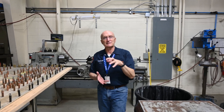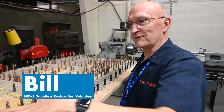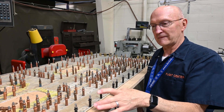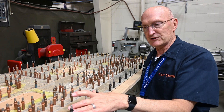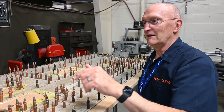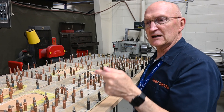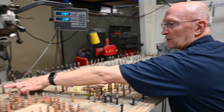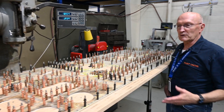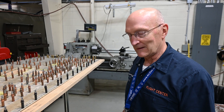This is the bottom skin for the SBD. The bottom skin has got so many inspection holes and access holes that we actually took the new aluminum, put it on the bottom, put the old one on top and drilled into the wood so that would be our pattern to match the hole pattern for the rivets. Now we've put it on the mill and we're cutting out the access holes, inspection holes — there's some control linkage that goes to the rudder back here. The lower main skin is two pieces of aluminum and each one is 11 feet long, so that's why you see it mounted on this big board.